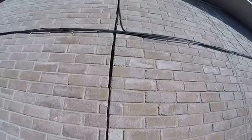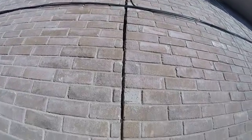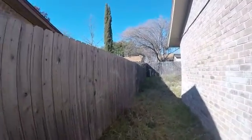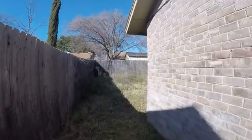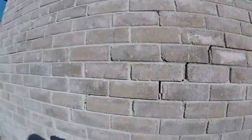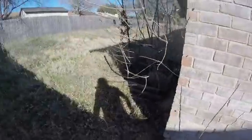Gate's pretty good. There's a very large crack here — I don't know if it's supposed to be that way or if it has separated that much over time. You can see it run all the way down, so that's a good sign of a foundation issue there. The fence is pretty good. You can see it's very overgrown in the landscaping. Here's another crack all along here, so definitely some foundation issues there.